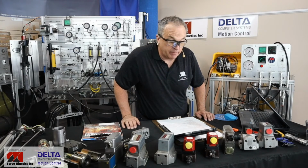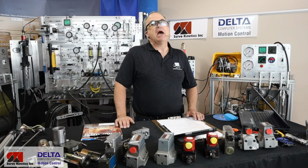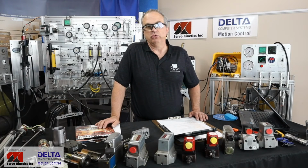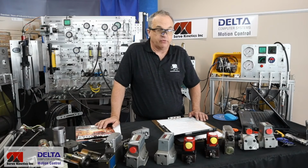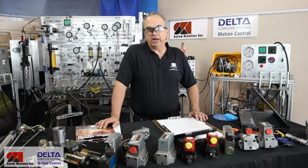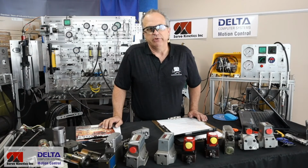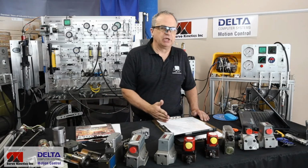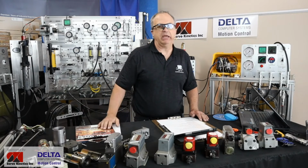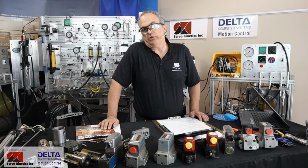Also a question coming in from Ian. Welcome again, Ian. His question is, what's the best way to explain the difference between a servo and proportional? Yeah, maybe this is a good time to address that one, because we're going to jump onto the tabletop here and look at some parts in a moment. And really, if you go back through the discussions on various hydraulic forums and expert journals over the past few decades, it has settled on the idea that any valve that can be modulated electrically and produce a variable amount of flow, with the adequate response needed to move your servo cylinder into the position you need in a timely and accurate fashion, is a valve that can be called a servo valve. If it helps you get your servo cylinder or your servo mechanism built and it has the right response, that valve can be thought of as a servo valve. So that is why the styles of construction now vary as much as they do.